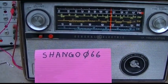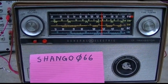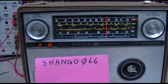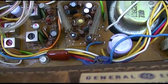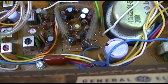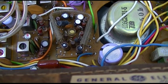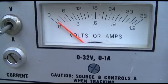It's right at the cutoff of the speaker. The last time on one of these, that squeal was the germanium transistors. They are the same package style as those in the Zenith I repaired in the previous video — that long skinny cylindrical package style. But it's getting worse as it runs. I wonder if I could spray some freeze-it on them and it would go away. So this little daughter board right here — this is the audio amp — we've got our pre-driver, driver, and two audio output transistors right there. I think it went away.